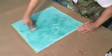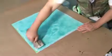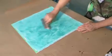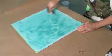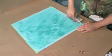On the last application of Versi-Lime, you must begin to polish the plaster while it is still setting. If you wait for it to fully dry, you will lose the window for polishing. Polishing during the final application is a skill, and you should practice on a sample before attempting a wall surface.